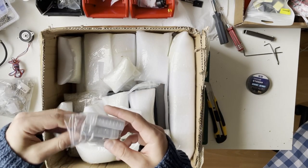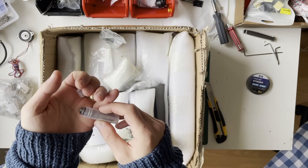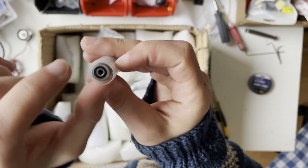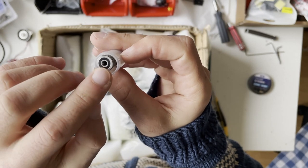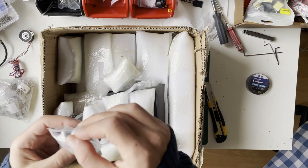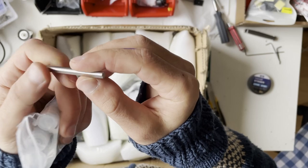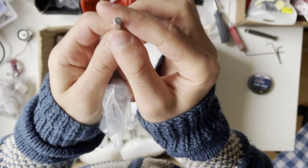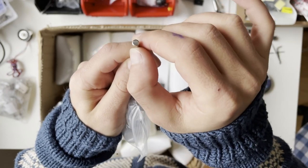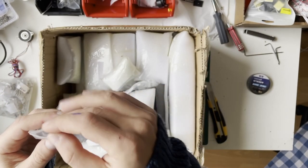We have bearings — they are the RS type with a black plastic cover instead of a gray metal one. These are the recommended ones, which is nice. We also have pin rods for the Z motors. They are D-shaped, which is important because one screw needs to sit on the flat face to hold the pin, otherwise it can slip.